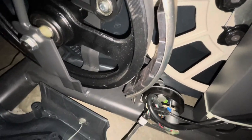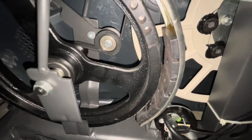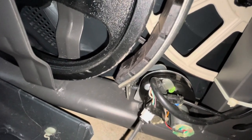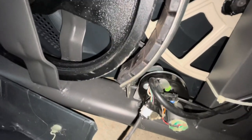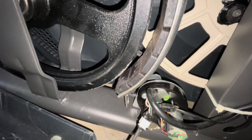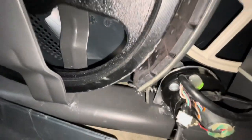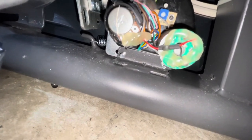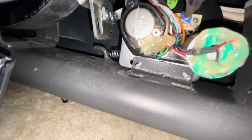I'm gonna hit the highest speed — 25. Actually let me take it back to one. At level one we got basically nothing, and now I'm gonna hit 25 — watch this, it's barely moving. You can see there's still a big gap between there. So how do you fix this issue? Right here — there's a potentiometer. That blue piece with the white Phillips head. Rotate that just a little bit.